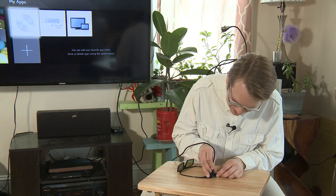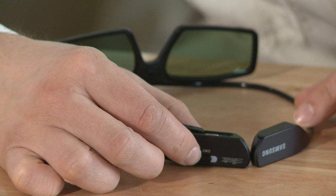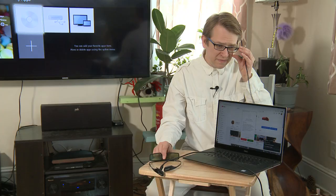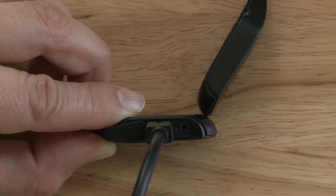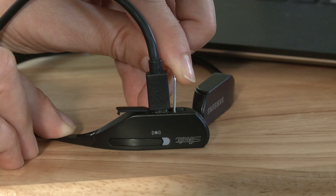Let's see if it charges. This isn't in the manual, but if you plug it into a USB wall charger, it might result in the glasses not turning on with battery power, or even when they're plugged in. I am able to recreate this situation consistently when I leave my glasses plugged into a USB wall charger. If you find yourself in this situation, plug your glasses into something with a slower speed, like a computer, and push the reset pin on the glasses for 3 seconds. You should see the LED on the glasses light up and begin charging.